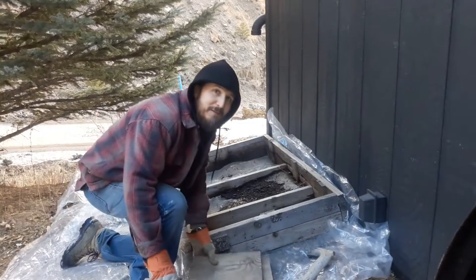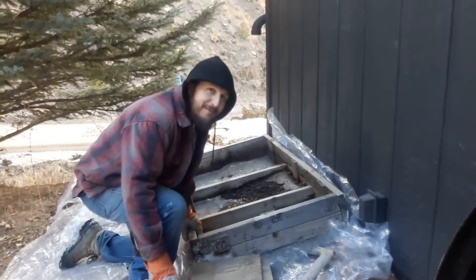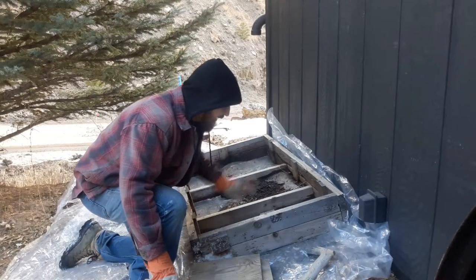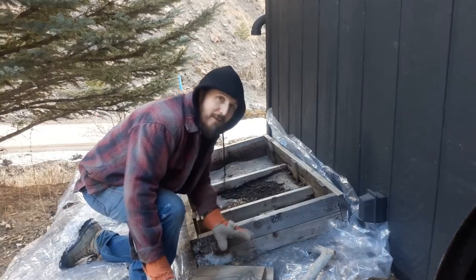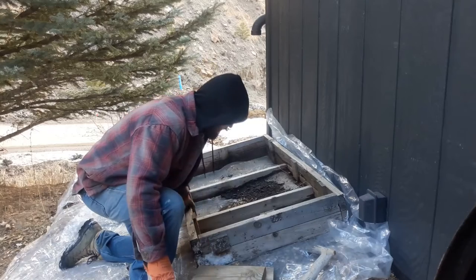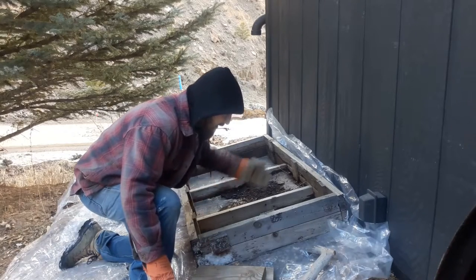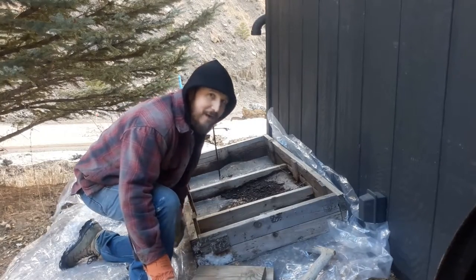You can see it's super sloped here. That's going to make all the water run towards the front. We probably don't want all the water running towards the front in the box itself, but once it hits below the box we do want it to run down the hill as opposed to running into the house. I'm just going to lift up the front end of the box so that the box stays flat but the water will continue to go the direction it's supposed to go.